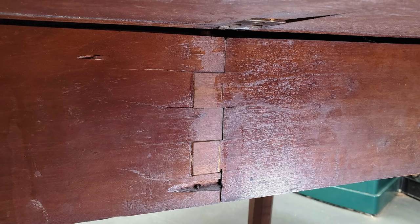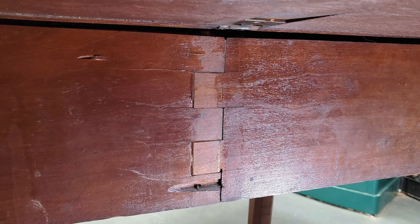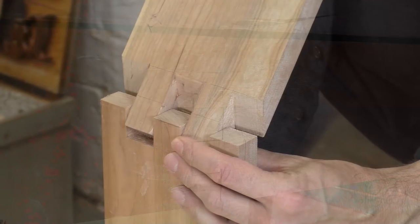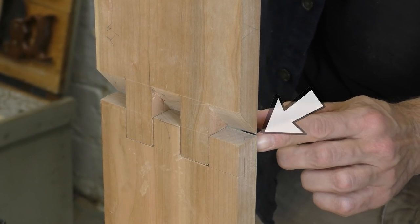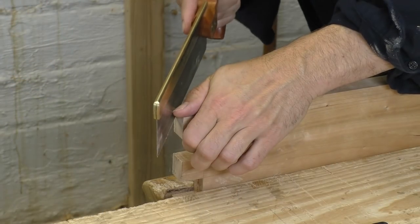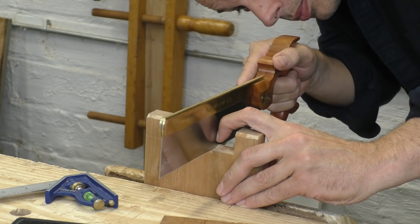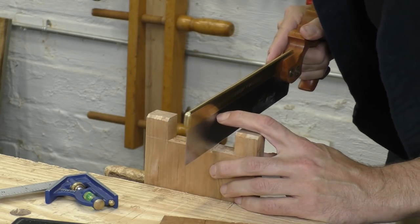We're making progress, but the joint still doesn't look quite right. Going back to the original, I expect to see a little gap where the moving section touches the stationary section, but the fit is really tight. I think there's actually a bit of an overlap where that slanted part sits on top of the other side of the joint — you can see the gap over at the far right. I want to get rid of that and put a little bevel here so the parts can mate neatly together. I'll make that bevel with a dovetail saw and a bit of careful chiseling. I also need the joint to be a bit deeper so the pieces can overlap at the tips, so I saw down just a bit and then chisel out the waste one more time.